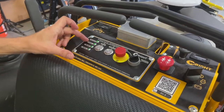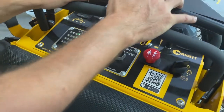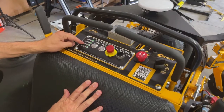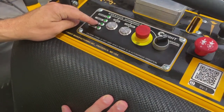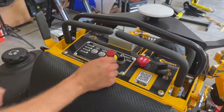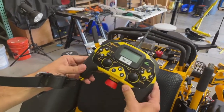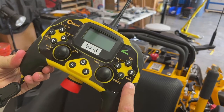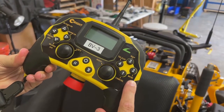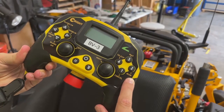Once that button is pressed, the map is blinking and it is drawing a map. You mow the boundary of the area you want, and you mow around. Once you get back to the start, it's going to blink on the plan to say it has a plan, and then go solid — the mower is ready to mow. There is only one thing you need to do: switch the mower over to autonomous to allow for autonomous control, then take the remote and press the mow button once you are safely 10 feet away. The mower will localize, take off, and begin mowing in the area that you set. For more on that, check our other videos.